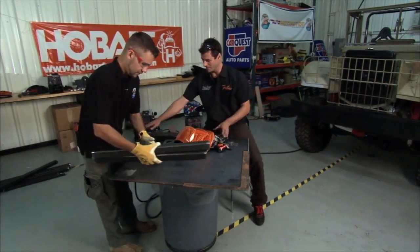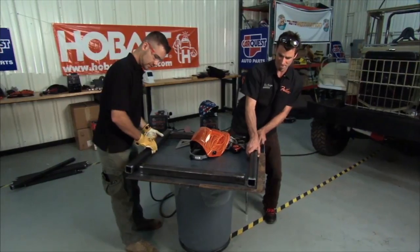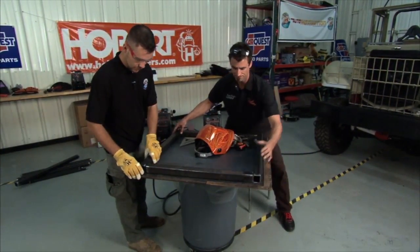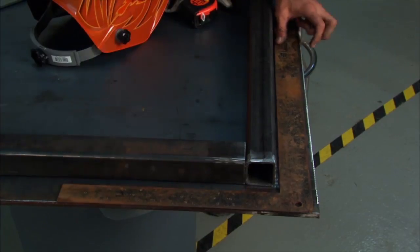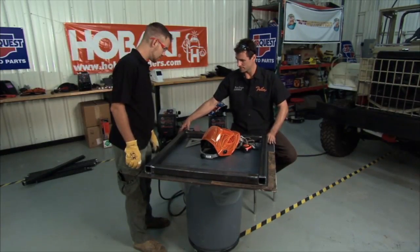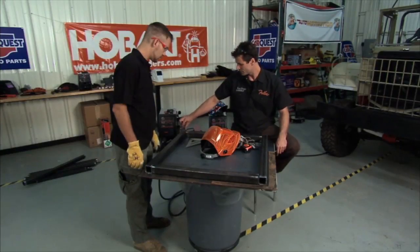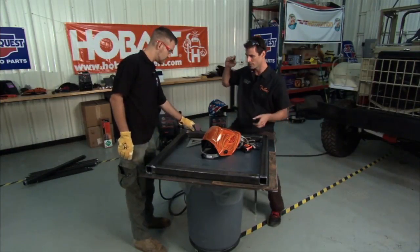The magical question — did he cut them the right way? Let's check it out. This is going to end up the base, and the great thing about having this little setup is we already got a table. We'll square this thing up — be sure you use a square. Our length looks good. I think we just need to get this tacked together and it should turn out really nice. It looks like we still have some mill scale on some of these spots on the ends that we need to clean off, so let's get our grinder and clean that off real quick, then we'll be ready to tack it together.